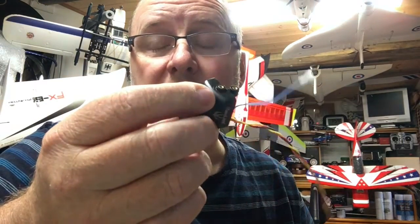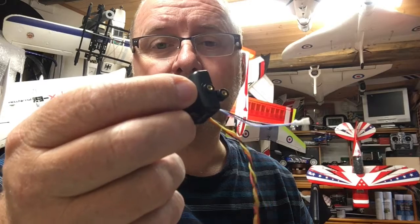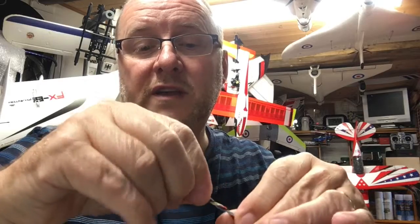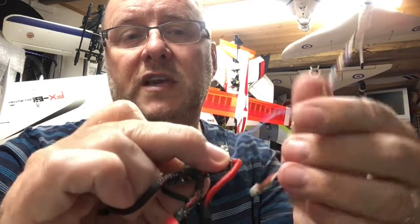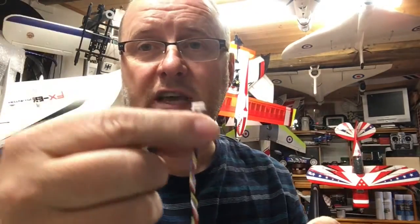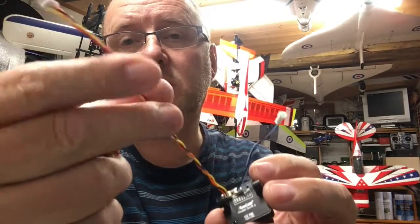So you get a little heads-up display where you can set your name, set whatever timer you want, and the voltage. When you power this up you can have a timer running — but it's no use to man or beast unless this has to be connected. I don't particularly like this, but it is very good to have, though I don't like the way it's conventionally connected. You need to solder this blue wire onto your power distribution board with the red wires — the red wires being your XT60 supply. That will take your battery voltage up the blue wire, plugged into the camera, to give you the actual voltage on your screen. If you want that, you need this extra larger plug. If you don't want it and you're not going to use it, then just use the three-pin plug.